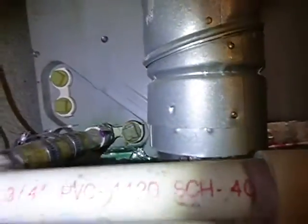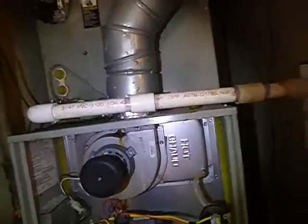We've got some rust forming in here, which is probably coming from your evaporator coils. You do not have a p-trap. This portion isn't insulated — that part they insulated, but not this one. It doesn't have a p-trap and you don't have a secondary drain. You don't have to have a secondary drain, but you can have an emergency float switch. You don't have anything, so if this drains, it's going to drain all over the wood and cause damage.